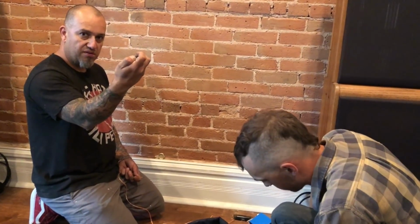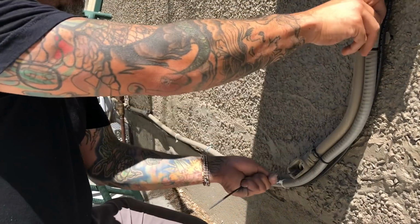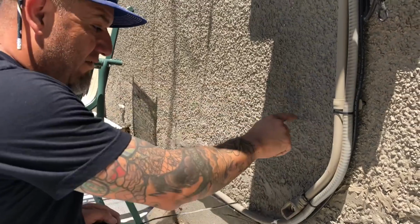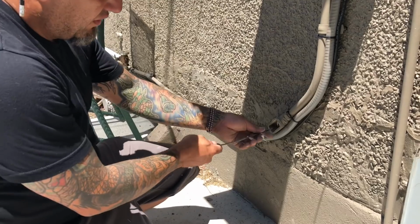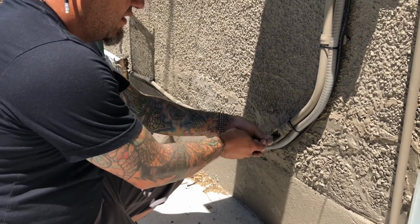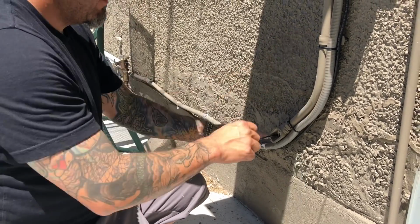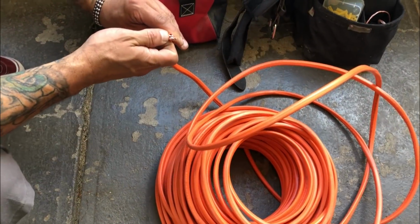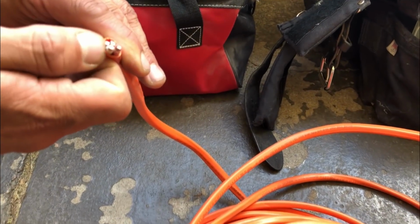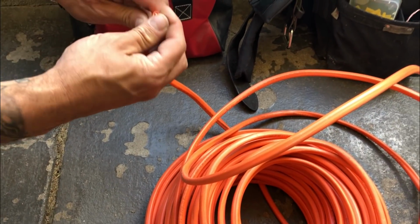Wow, so we're isolating the ground completely for that one, and it has an isolated hot and all that stuff going to it. Okay. So the one that I use for the secondary ground would be colored, coordinated with tape, so everybody knows that they would see it. But you could pull this one circuit from here, sleeve it all the way through with the 3/4. You can put a box on the other side too if we need to, and then we can get rid of all the Romex insulation that they have in this pipe. Right, that might be the way out. Might be the way to do it, right? Grounded. And that's the one right by my thumbnail. There's neutral, hot, and then this is also going to be a ground.